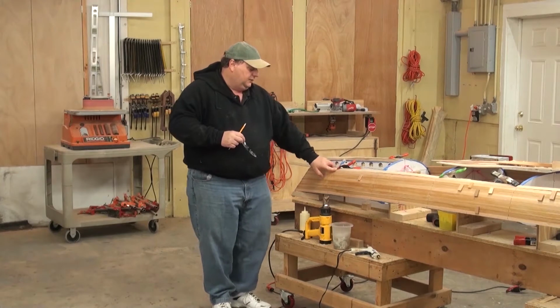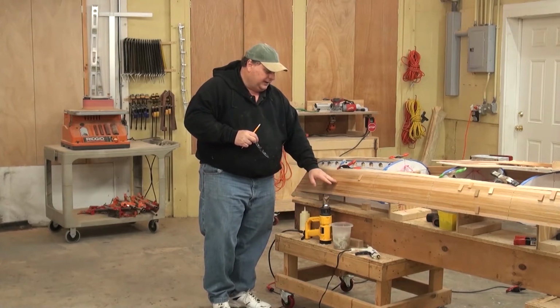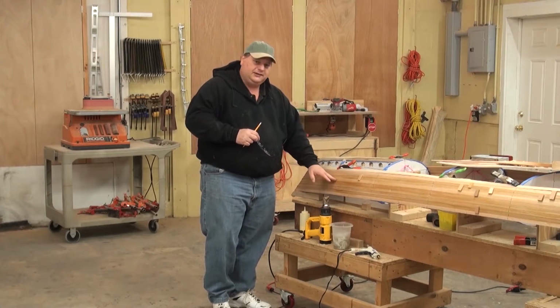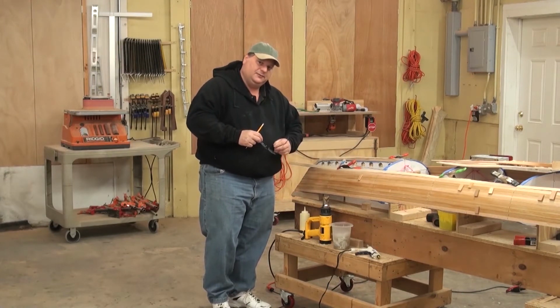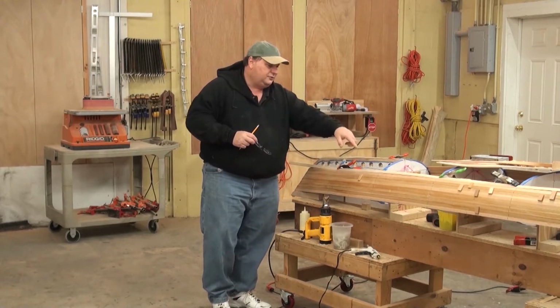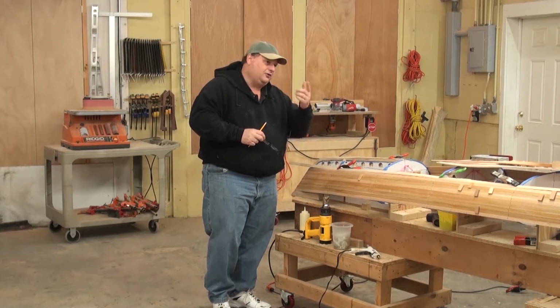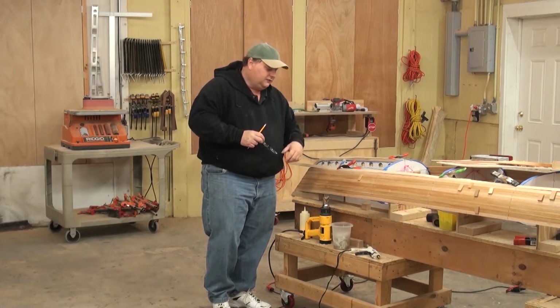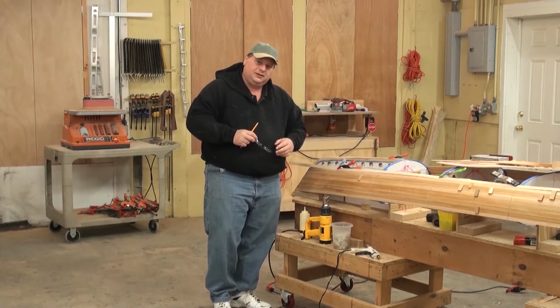Now, you probably noticed that I got some finger clamps up here, right? After I get past the first few that are either easy stapling or easy holding with a glue block, then I start putting screws behind the forms here, and I just clamp them down with some finger clamps. Behind each one of these forms, I've got a little 1.5 inch sheetrock or deck screw screwed in there, and it allows me to put my finger clamps on, so I can temporarily attach, all right?